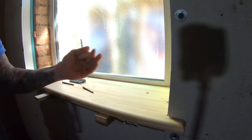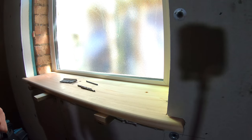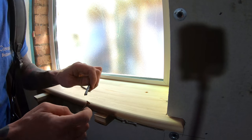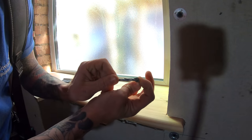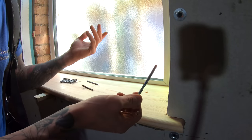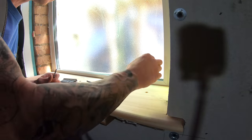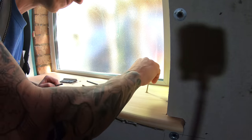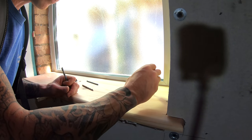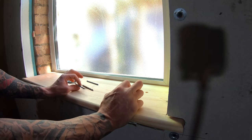Then I'm going to take the sill board out and drill through with the proper 7mm masonry bit. The reason I'm using a 6mm bit first — a smaller bit — is because obviously we want to leave as much meat in this hole as possible. By going through with a bigger bit you start to eat into the actual width of the sill. The smaller bit you can get through here the better. You could even go smaller than 6mm — a 5 or 4mm — just to make an indent in the block work underneath, then you move the sill and do the proper hole. All you need is enough for the screw to fit through. Because if you take out too much meat from the sill board when you pull your screw through, there's a potential it could just pull straight through and then you can't fix it down.